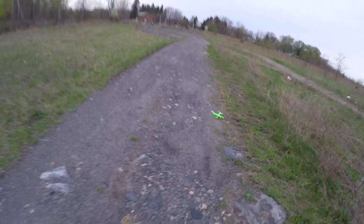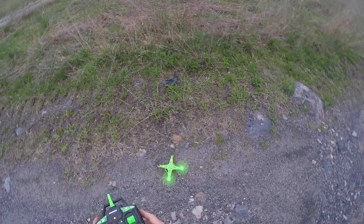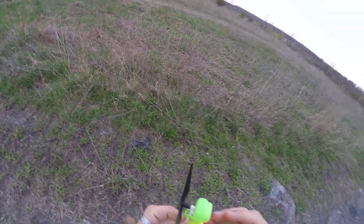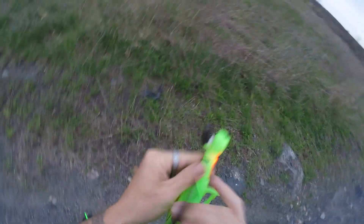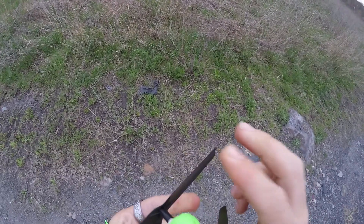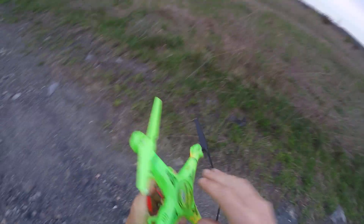So this is not a flight time test — this is a learning test. We're going to throttle up to show how to tell what motor is bad, or what motor's going out, or what gear is wrong. It's wherever the drone leans to. These three motors are trying to lift up — they're working properly. This one is the issue. The motor dropped back down. You can see the silver motor in there, and it's dropped down a little bit. I can push it back up, but it's only going to drop down again. The only thing I could suggest, because the motor is still good, is to try to get a little bit of glue in there and glue it up.